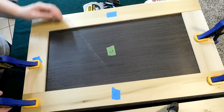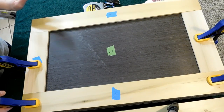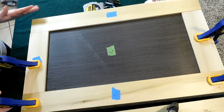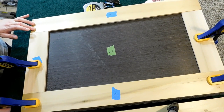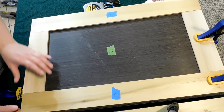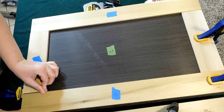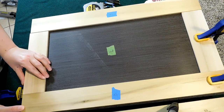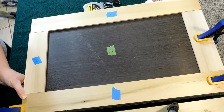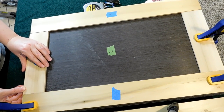I need to make an adjustment. This side down here is thinner on the beveled part than it is up at the top, which means I need to move this top section of the board over a bit. I'm going to unclamp this one and this one and just barely move it over to where I need it to be — and this is what I mean when I say you have to eye them. Then I readjust the clamp to line it up.